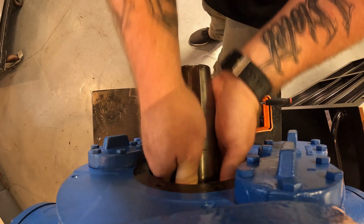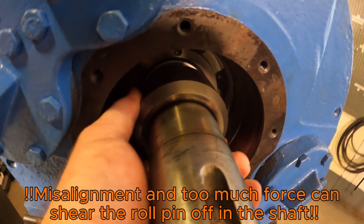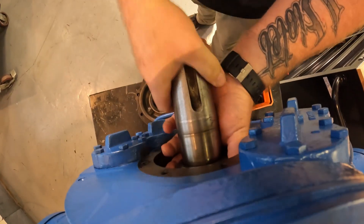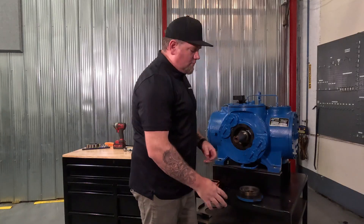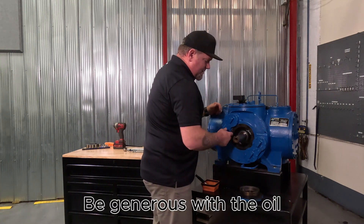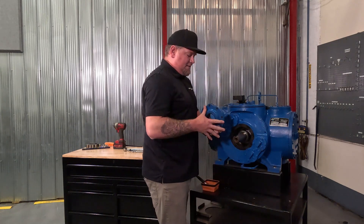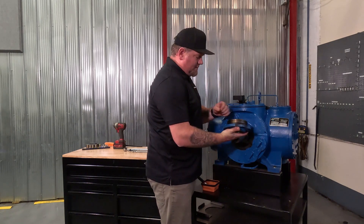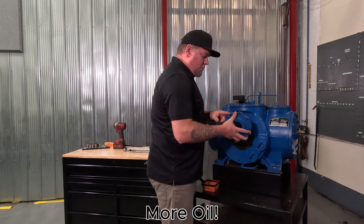Push the rotating assembly in and make sure that when you turn it, it is actually locked in place. You can hear a bit of a clicking — if you don't get that, it will twist and not go the full distance. At this point, lubricate the seal face with an oil can, applying a good liberal coating to ensure it's wet. On the seal cover, you'll have pressed in your new seal, your new stationary assembly, and you'll need a new O-ring on the outer side.